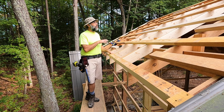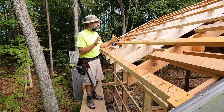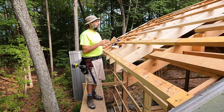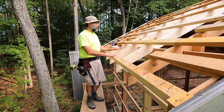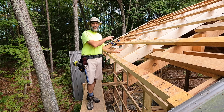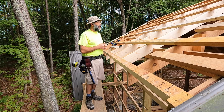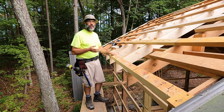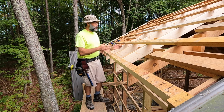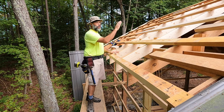I was a little concerned that maybe the structure had sagged, so I checked the ridge line — that's perfectly straight. I checked the width — it's consistent with the way things were designed. So this roof has not sagged or drooped or anything. I got to looking closer at these three particular rafters and noticed that the knot patterns had all aligned on these rafters, which told me they came from the same cant, same log. I've sawed into some logs where the lumber goes wild either as you're sawing or a couple weeks later as the lumber is drying out.